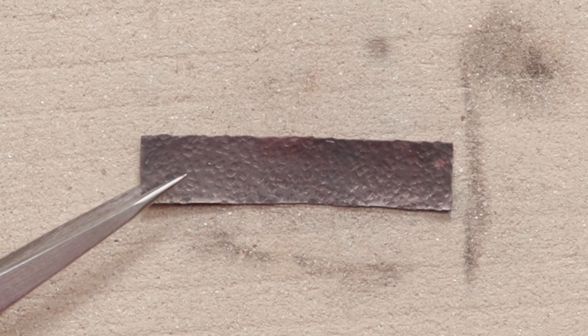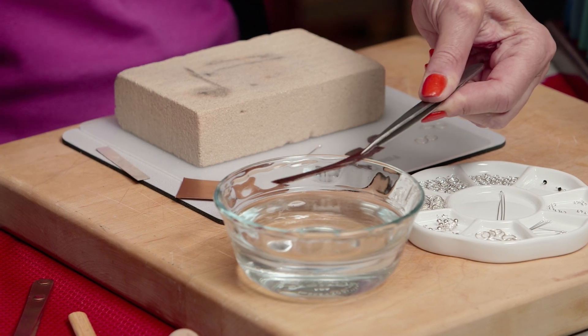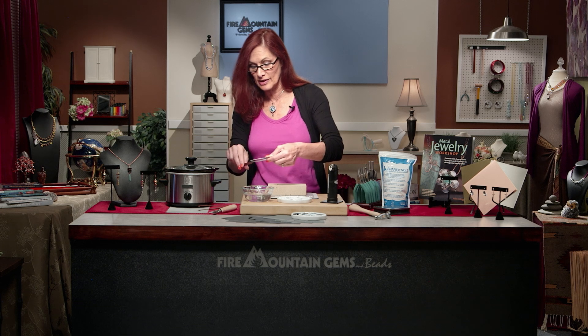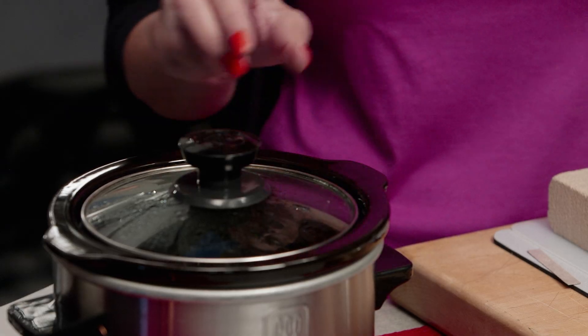Well, that should be enough. Maybe it's not black — maybe it's just dark brown. You don't want to put your metal directly into the pickle pot after you've soldered or annealed it, because you don't want any of that heat to cause it to splash up and hit you or your work area. And when you handle items that go in and out of the pickle pot, you want to use copper tongs. Some people might use wood tongs, but over time those are just going to get ruined from the moisture.